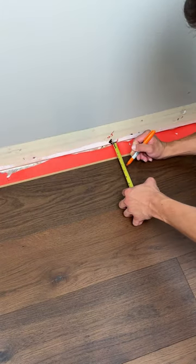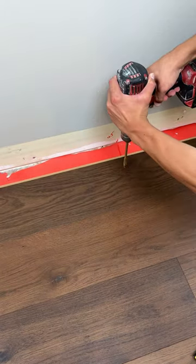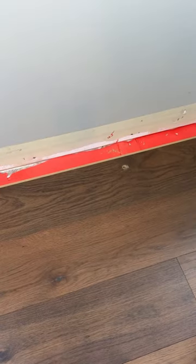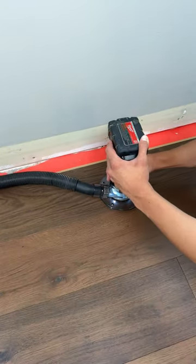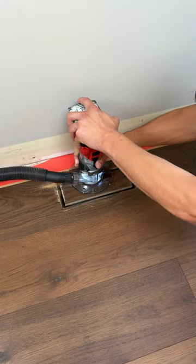After the flooring was installed, I was able to measure where it was underneath so that I could drill through to it. Now I'm going to grab my router with a flush cut bit and go ahead and set it to just below the flooring so that it follows the damper underneath and we get a perfect cutout.